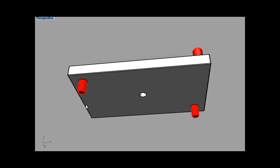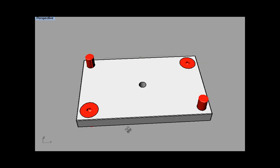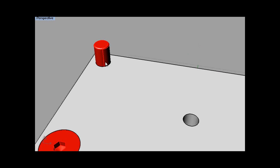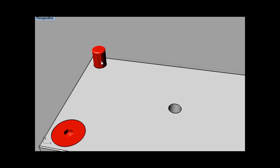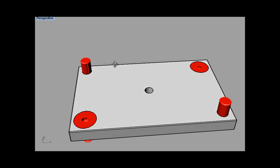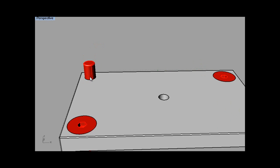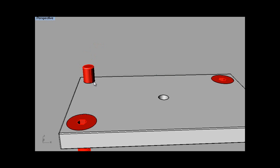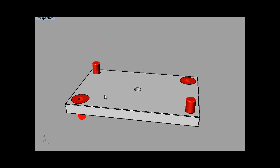Now you'd obviously have to work out your own fittings for this. I don't know what type of table it is on mine. It's just screws, threaded holes, so you could just measure them and screw them straight down, but it might be T-nuts and you'd have to come up with a way of holding it. And then these are two interference fitted pegs, so they're just tightly fitted in. Again, it could be best probably out of tool steel if you can get it, or just normal steel.